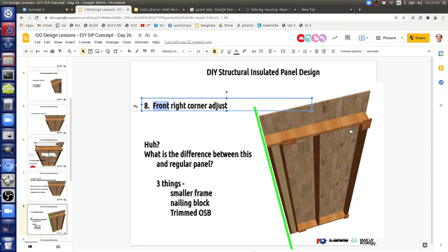You'd be questioning, like, what is that? Well, that in there is exactly a 2x4, which means that 2x4 plus the 1.5, which is 3.5, plus 1.5 there, that's 5, and that you got 1.5 more there. But that's enough to attach the next wall over through the 2x6. So this is the corner, now you're coming in like this. Here, that's enough to attach.